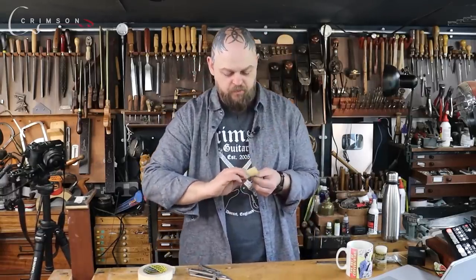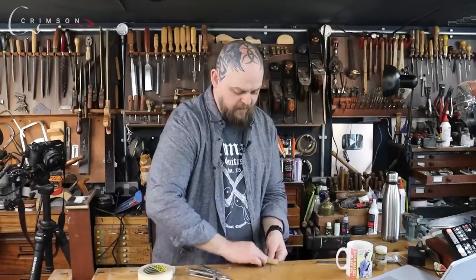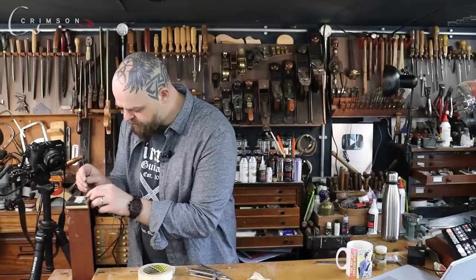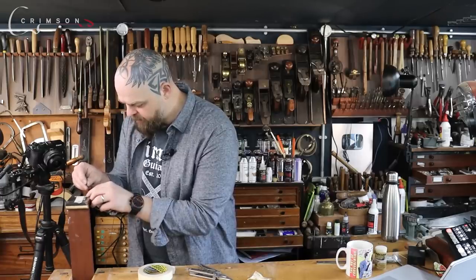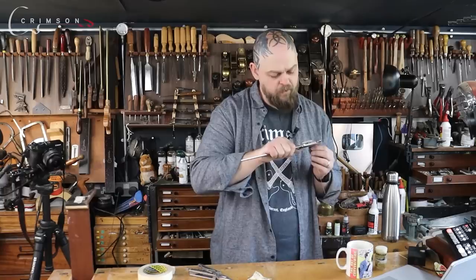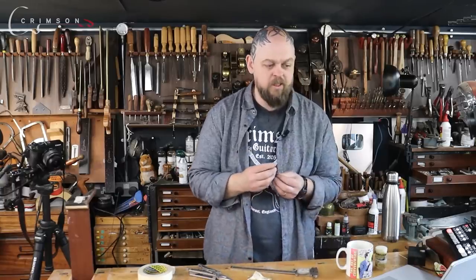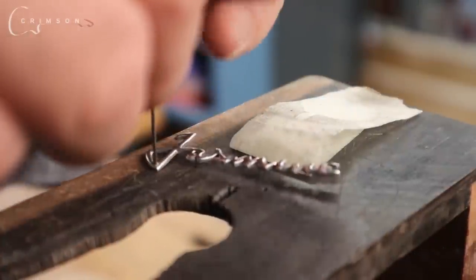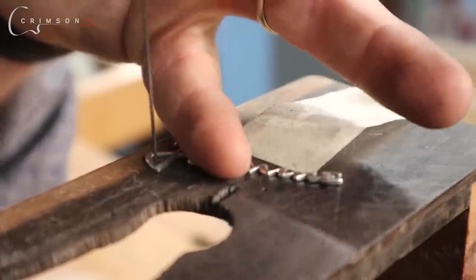Just a little bit of 240 grit to clean this up. Okay, so this should be slightly larger than the hole. 5, 6, 7. This is 0.8 actually. So I've got a tenth of a millimeter. My hole is a tenth of a millimeter too small. It feels like Formula One. Yeah, half of a millisecond behind him.